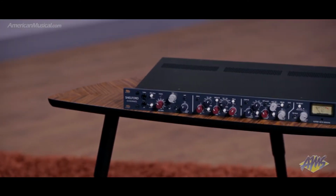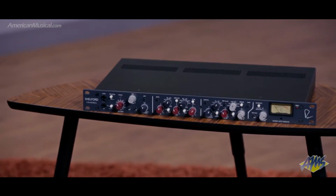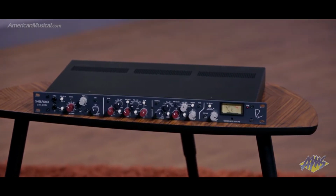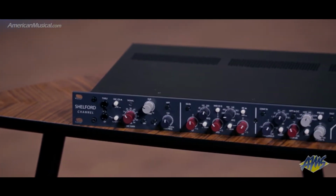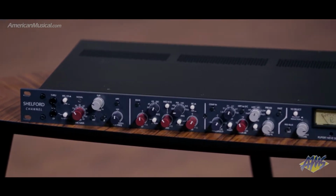The Shelford Channel represents the culmination of Rupert Neve's most famous designs of the past, brought together in a flexible, compact package. Featuring the first transformer gain preamp design Rupert Neve has created since the 10 series, the Shelford Channel's preamplifier is capable of providing 72 dB of gain in total, the first 15 coming from the custom input transformer